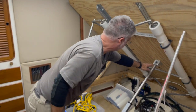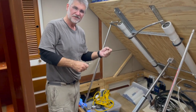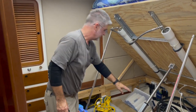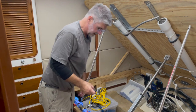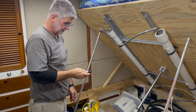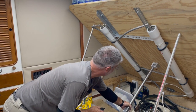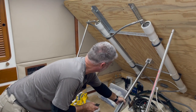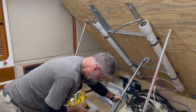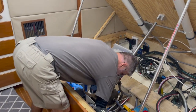I have the top bolt out. The bottom bolt is all the way in but binding just a little — I can't pull it out. That might be because there's a little load here. So I'm going to use the remote — this is how we lift the bed — and just hold the linear actuator and draw it in a little bit. Now that it's loose, I'm hoping I can take the bolt out the rest of the way.